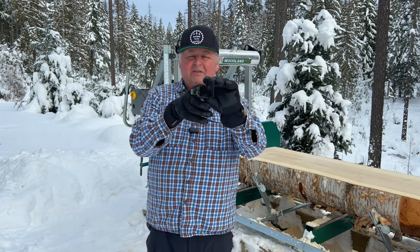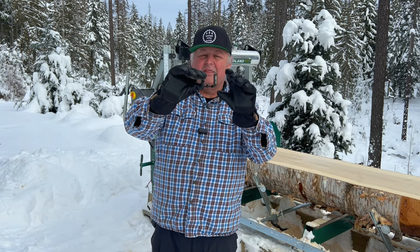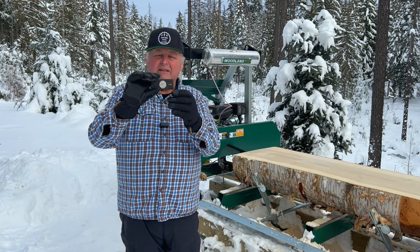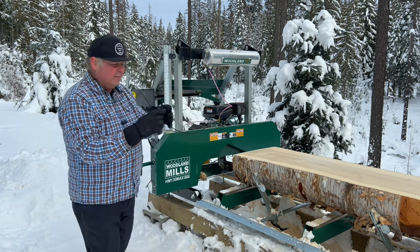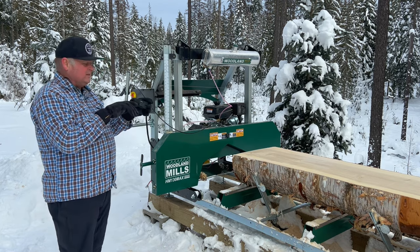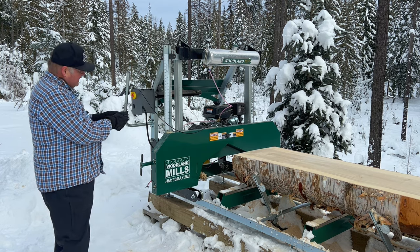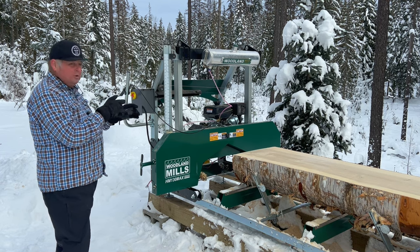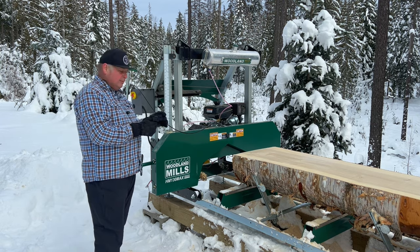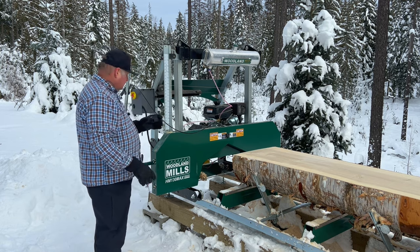And I noticed like Sandy used a crescent wrench to kind of tweak this a little bit to line it up. And I don't know what others are doing, but I thought what I would do is I'm gonna go ahead and put a magnet on here, a high powered rare earth magnet. And then I've already got my wiring harness on and hooked up, so the lasers work. So then I can put the lasers in here and get them mounted horizontally. And then I should be able to position this and line it up with the blade perfectly. And then I can go ahead and mark the holes and then drill the holes. So I'm gonna give that a try. I know that's a little bit different than what other people have been doing, but I think it's gonna ease the installation. So let me move you up over here so you get a closer view, and we'll give that a try.